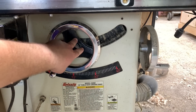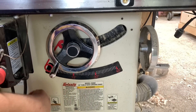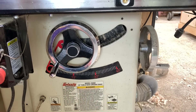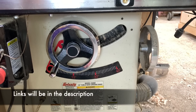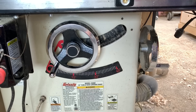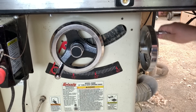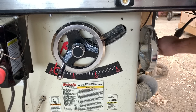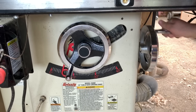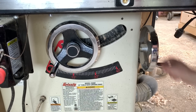The saw blade adjusts here for up and down and there for bevel. This gauge right here I never use — I did a review of my digital angle finder a few weeks ago and I will link to that in the description, because that's what I use to set my angle. I don't really use the bevel indicator here, but once you get it going it's got a big heavy carriage under here to move everything, and the positive stops on this were dead on from the factory and have been dead on ever since.